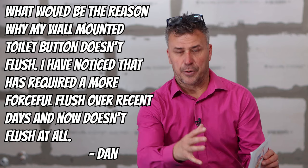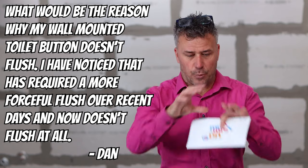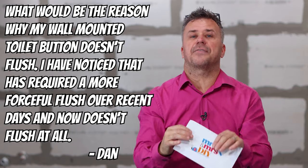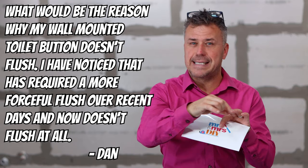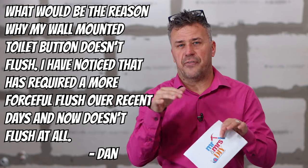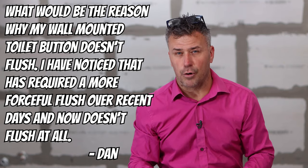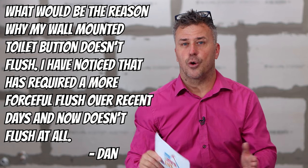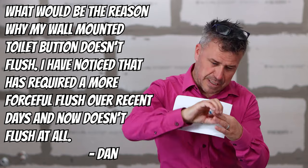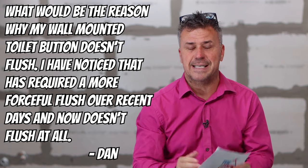It is the one that's suspended off the wall and all the system is behind the tiles. So where your plate is and you've got your buttons there for flushing, take that off, disconnect it if you can. You should be able to get your hands inside there and pop a little light in or even your phone and make a little video. Once you can have a feel around in there with that one hand, you might find a number of different things going wrong, because those systems inside there don't last forever. It could just be the trigger mechanism that's come off — they're on little springs and clips that go up and down. Once you push that in, they may have just come off and it might be a simple fix.